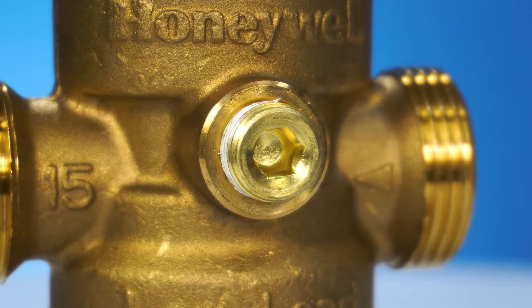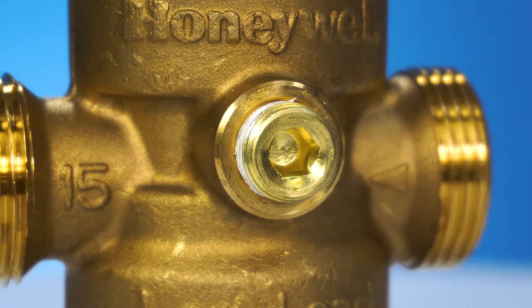So it comes factory set, adjustable, and really doesn't need to be messed with. It's got some gauge ports on there, which makes it easier to verify pressure. We have two ports here on the front and the back — they're interchangeable, so you can put a back outlet pressure gauge on there. It'll tell you exactly what the pressure is as a secondary reading. It's always good to double check to make sure you've got the pressure you want going into the house or building.